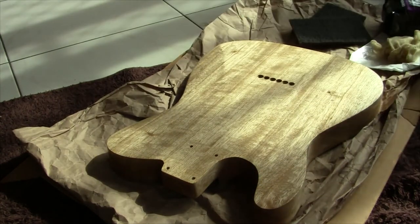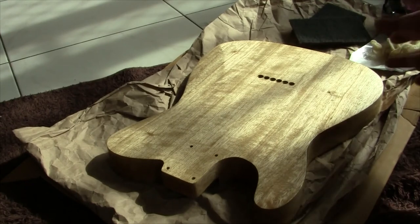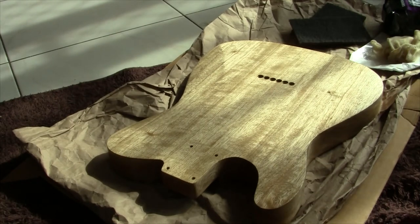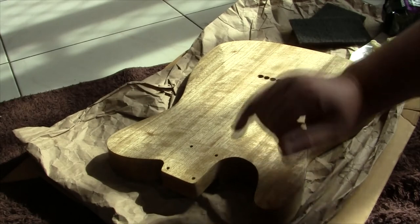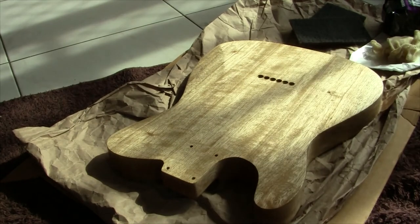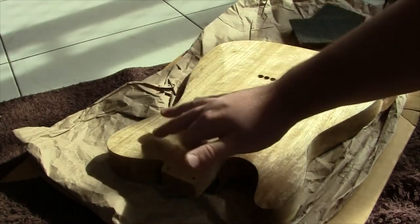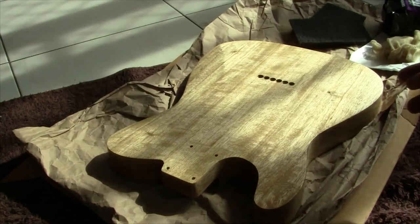And you want to make sure that any scratches or any blemishes are gone and it is as smooth as possible, because when you put the Tru-oil on there, it will show any little scratches or dings or anything like that. There is a small ding there, which came through shipping when I got back from New Zealand to Australia, and there's a little bit of knottiness on the wood, but I actually quite like that. It gives a bit of texture and looks.